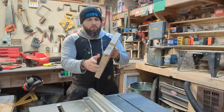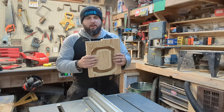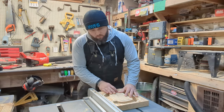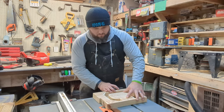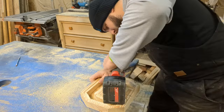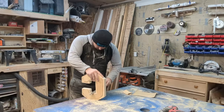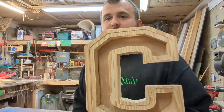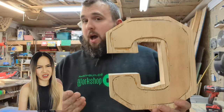With the back reinforced, I'm going to use the table saw to get the roundabout cuts and remove the bulk of material, then go back with the jigsaw to cut out the inside. Now we use the jigsaw to cut the bulk of that interior letter out, then bring it over to the bandsaw where I can be more precise. Once all that material is removed, it's back to sanding. I'm trying to make something that looks CNC'd, so I'm trying to make it look really nice. The front looks decent and the coin slot on top looks decent.